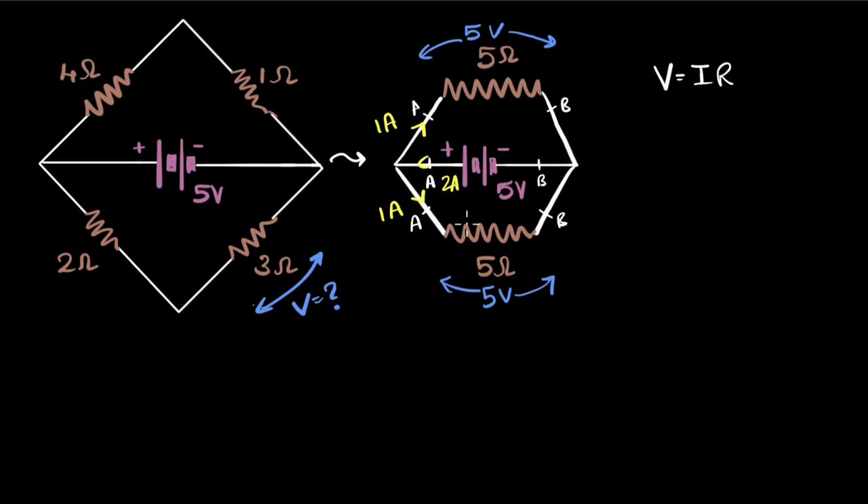I have solved this entire circuit — I know the resistance, voltage, and current through both resistors, which means I don't need to reduce it further. Now I come back and see which values I can use in the original circuit. This branch corresponds to this one, so the current here must be one amp. I replaced this with five ohms, so that same one amp flows through each original series resistor in that branch — and similarly one amp here.